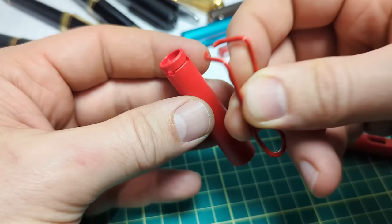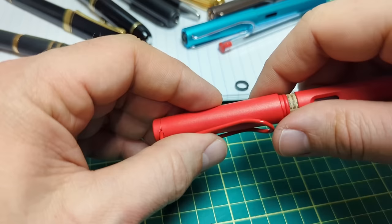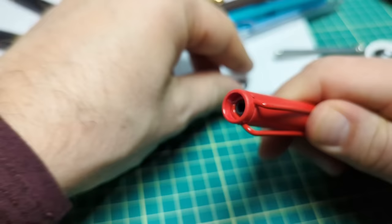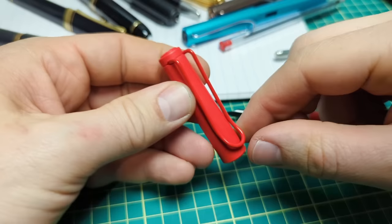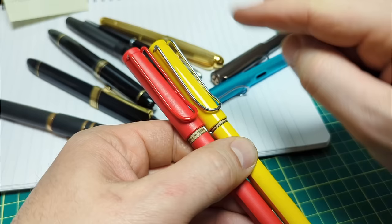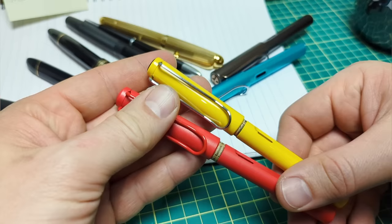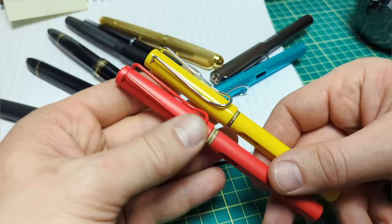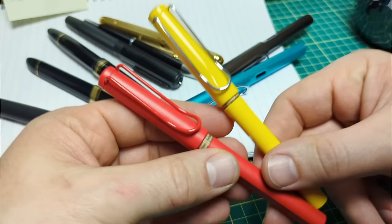Now your part is done — made extremely fast, very low cost, zero wastage. Put a coating on it, and now you've got to put all the parts together. Let me show you how quick and easy this goes together — no tools required. You just open the clip up a little bit, slide it into the holes, flip it over, drop in your cap liner. Lamy will have a proper assembly jig to do this whole process, so it'll be even quicker. Pop in your seal, pop in the end finial, press it in, and now everything is assembled. Like I said, this may not be the prettiest clip compared to some others, but from a design point of view — closing the whole loop — it has to look good, has to be functional, has to be reliable, and the cost to produce it is extremely low, with really no errors in production. You can't reduce the cost to make this part any further, and that, in engineering terms, makes it essentially a perfect part.